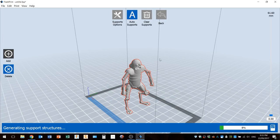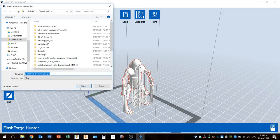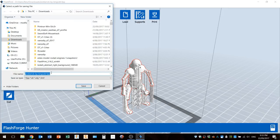Then I'll put my supports on, and what I'll do then is I'll actually go back, save the supports to the file, and then I'll go File, Save As, and make sure to change this to STL. So change the file extension here to STL, and I'll change also the whole file name and try and fool NanoDLP